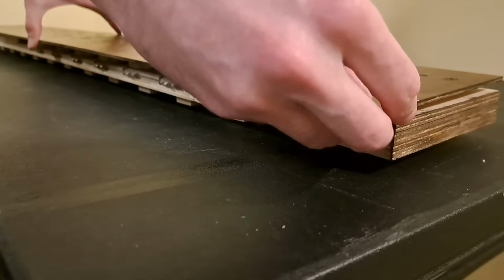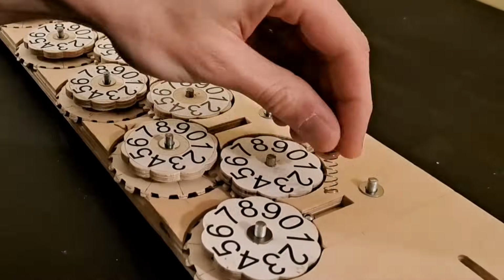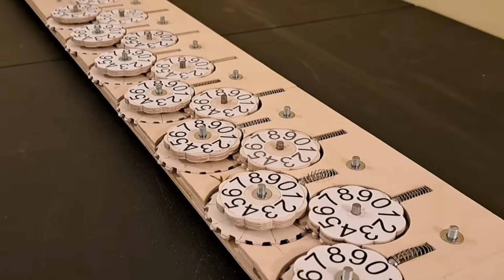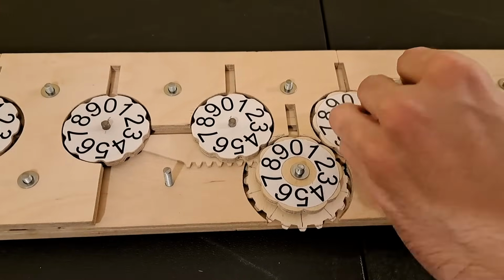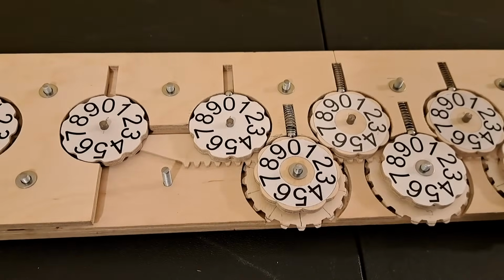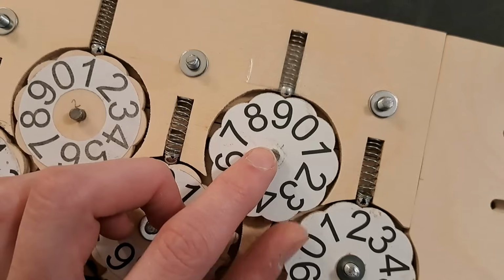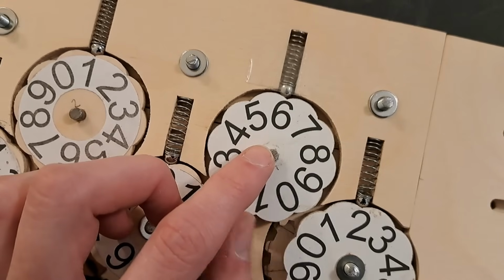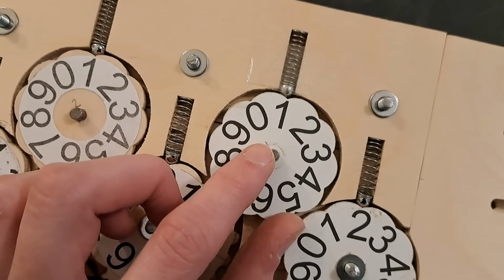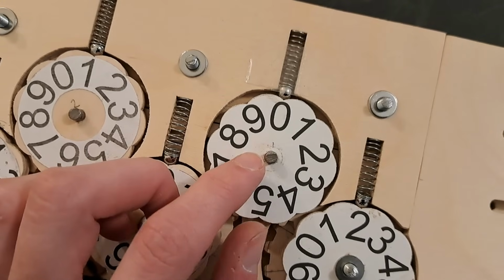I actually glossed over another mechanism which keeps the machine digital inside this assembly. See, all the dials also have bumps that spring-loaded ball bearings ride against, ensuring they turn a full number at a time, maintaining digital certainty and keeping everything discrete. It's not immediately obvious why a phone or a laptop is digital. Sometimes we might think it just means electronic, but what it really means is that it operates on discrete events. In this case, the teeth of gears, or in computers, the binary states of transistors.